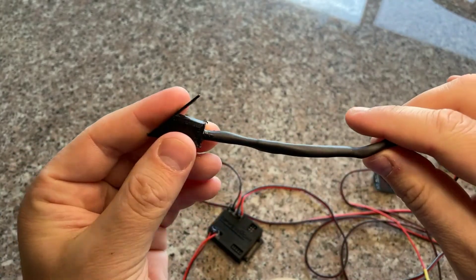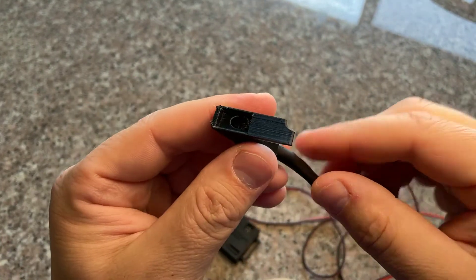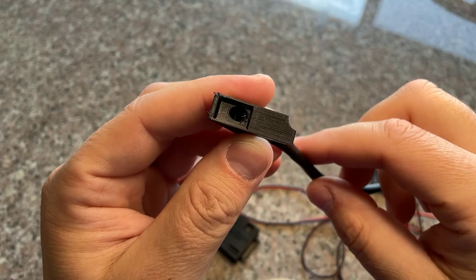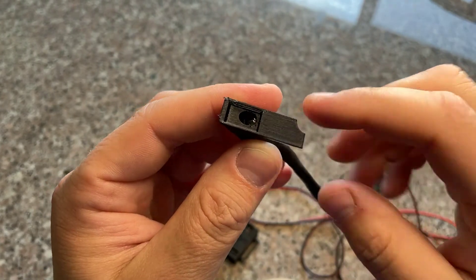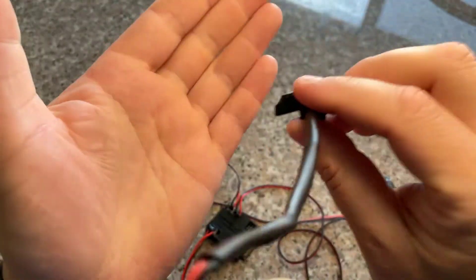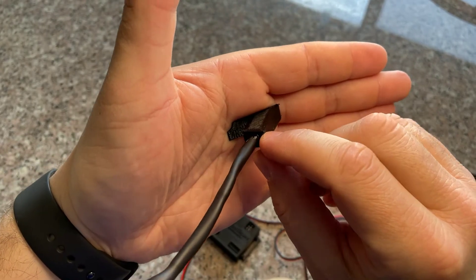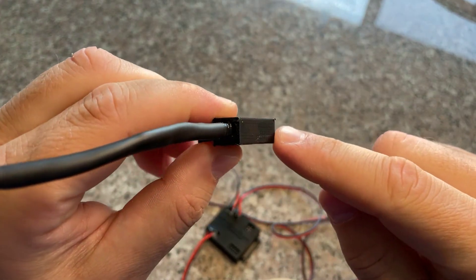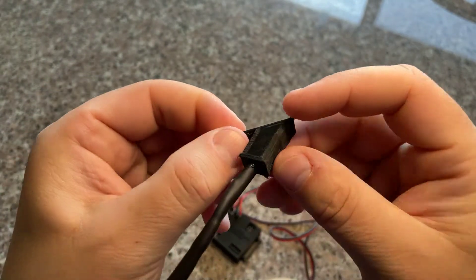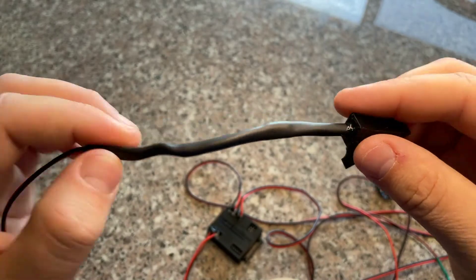The LED piece took a really long time to design to get the angles right. There's a cutout here because there's a screw behind the trim around the dash or LCD screen, so I had to make this so it snaps in really easily. You can see the LED and a cutout to make sure the light shines on the sensor. It just snaps into the side with good retention, and your headlight symbols above and below are not blocked at all.